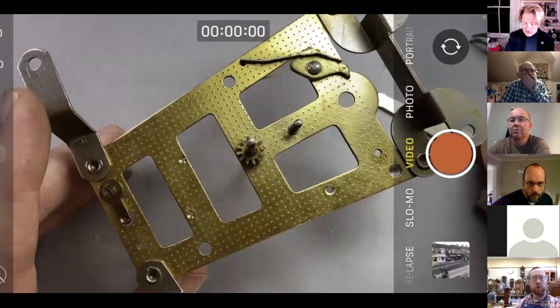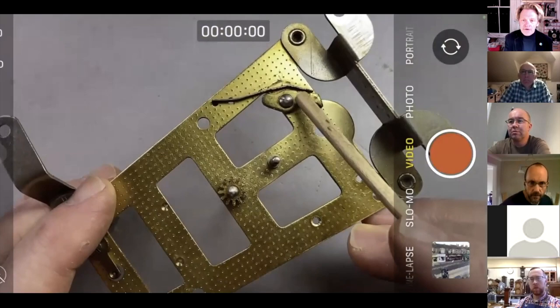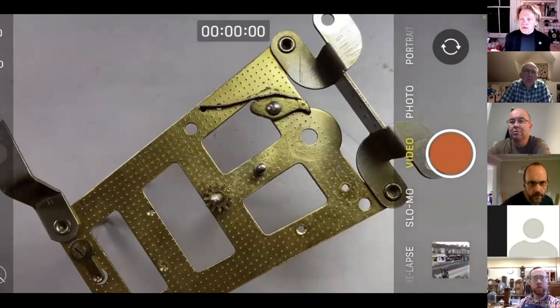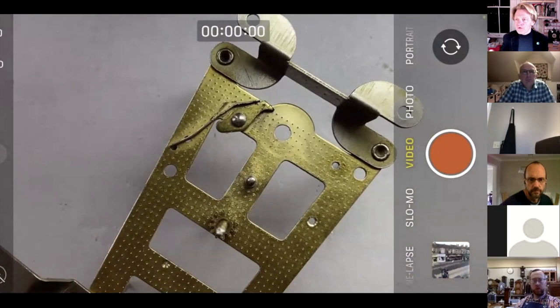Quite a cool little point about these, in fact, about all clocks, is maybe we don't need to start talking about what is a proper job and what is not a proper job just at the moment. But you can see here that there are components like these movement straps and the ratchet click and the click spring that are permanently riveted to the clock frames. Eventually they're going to wear to the point that they don't function. We're talking about those questions about, is it safe? Is it going to cause personal injury? Well, obviously if the click wears to the degree that you think it's not going to engage properly, it could release the mainspring power and then the key flies around and it might break somebody's fingers, which is obviously what we want to avoid.